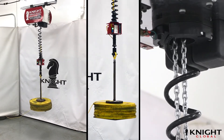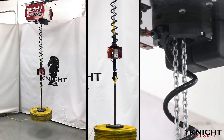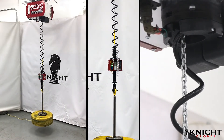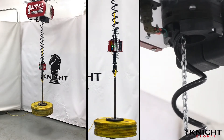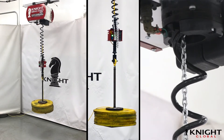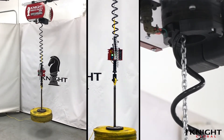This will result in the safety chain suspending the load, preventing any potential injuries to operating personnel. As demonstrated, the SDS servo hoist is capable of operating after the primary chain breaks. It is advisable to replace both primary and safety chains soon.